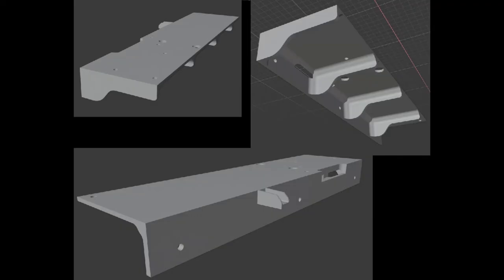The next item is the stand. This is basically just a large flat platform used to support everything else. It bolts to the side of the machine using four M4 T-nuts — three through the side of the stand and one in the tab to line everything up. The notch pre-cut in the front of the stand was used to align to my Z motor. If your Z motor is in a different location or if you want to move the stand around, you would need to adjust for that notch either by designing it in advance or cutting it out after.